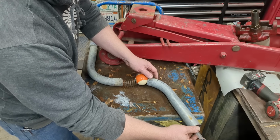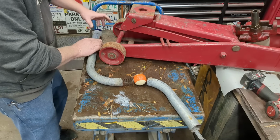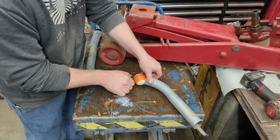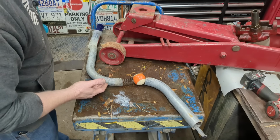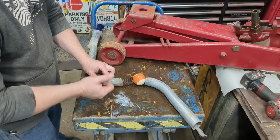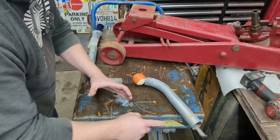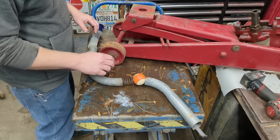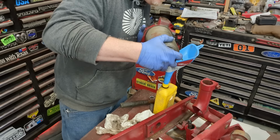So this pushes pressure. It pushes the spring in, allows fluid to escape, goes up here, pushes this up, and then when this tries to push back, the spring is closing off the entrance. That's a hydraulic system. Easy as that. And then to relieve the pressure, there's going to be a bypass hole or something right here, and that is what unscrews. That's generally what you unscrew with the jack handle, and then that just bleeds off the fluid back into a reservoir that this can pick up again, and it just cycles non-stop. That's the hydraulic system. All jacks like this, even bottle jacks, this is where you fill them.